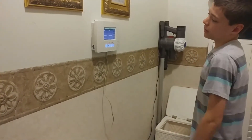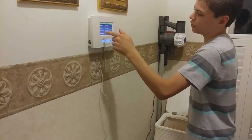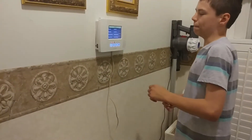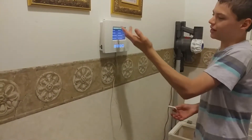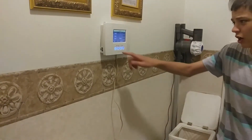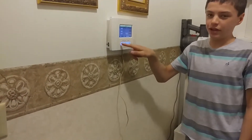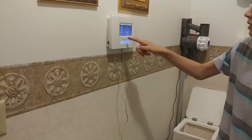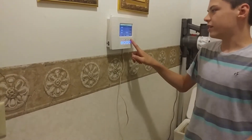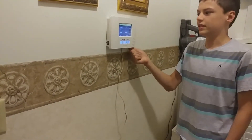The nice thing to do next is Device Type — we want to hit Window. By default, the zone type is Perimeter. You want to keep it Perimeter because you're not going to enter your house through a window, so you wouldn't need to program it as Entry. For Alarm Report — do we want this alarm to go to the central station? Yes, we do. Chime? Yes. Supervision? Yes. We want this supervised so that if the battery goes dead on the sensor, the alarm panel will go into trouble.